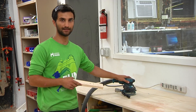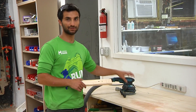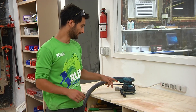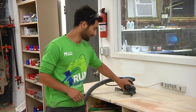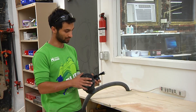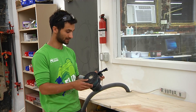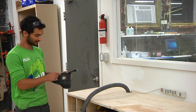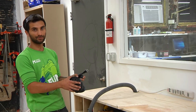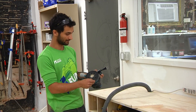This is usually my go-to hand sander. One, it doesn't leave marks. Two, it can remove a lot of wood. Three, putting the sanding pads on is very easy. The pads are backed with Velcro, so they stick right on immediately — you don't need to cut sheets to size. All you need to do is align the holes with the vacuum holes so that the dust can be extracted. If you don't do that, the dust builds up in your sandpaper and ruins the paper pretty quickly.